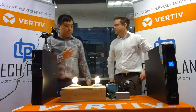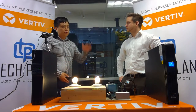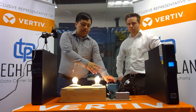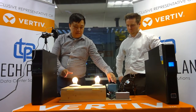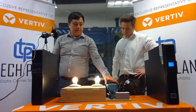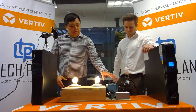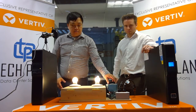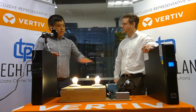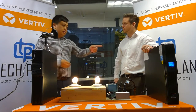That occurs maybe a couple of times a year, maybe more depending on your situation. But what could be more frequent is a sag or a voltage drop — it's not entirely off. We can simulate that with our variac. I'm going to go ahead and start dropping the voltage. The line interactive has to react to that. This is a variable resistor — I can vary the voltage going into the UPSs. We're down to about 90 volts and we heard a beep because the line interactive is now on battery. It has a sense and it's a momentary duty inverter, where the online double conversion is a continuous duty inverter — so the online unit is actually still running on utility, and because it's double conversion we can buffer that quite a bit more.